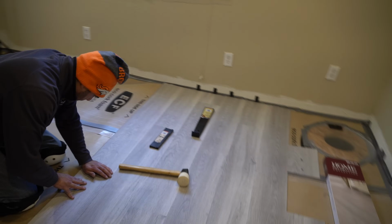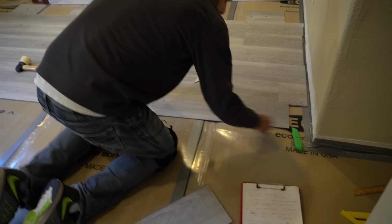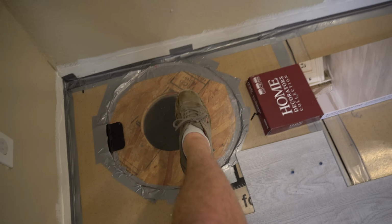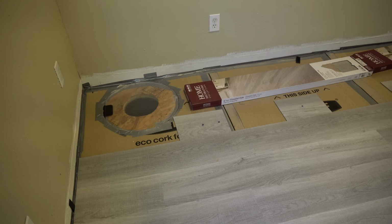And we wanted to make sure that these seams are aligned with this line. So what I did was figure out how many boards would fit in between so we have an exact seam right on here. And it came to 8 boards, which was 67.5 inches for us. The reason I chose that is I needed it far enough back to where I could leave the space open. So you could have started way closer to the wall. So then with these 4 anchors, we measured 67.5 and then we anchored it down right there and screwed it into the floor so it couldn't move.